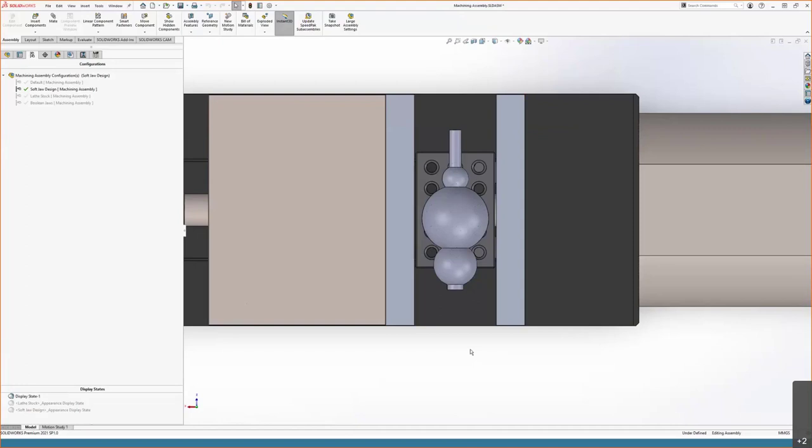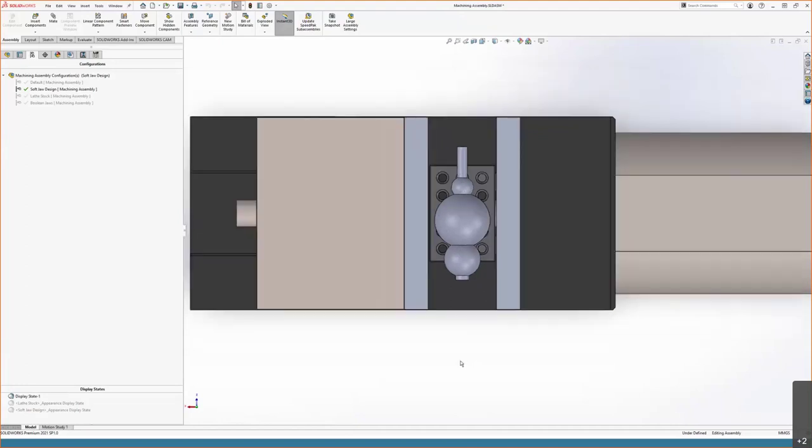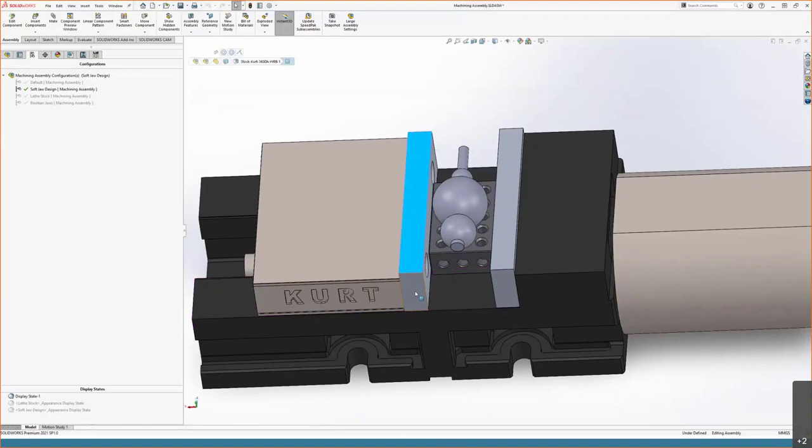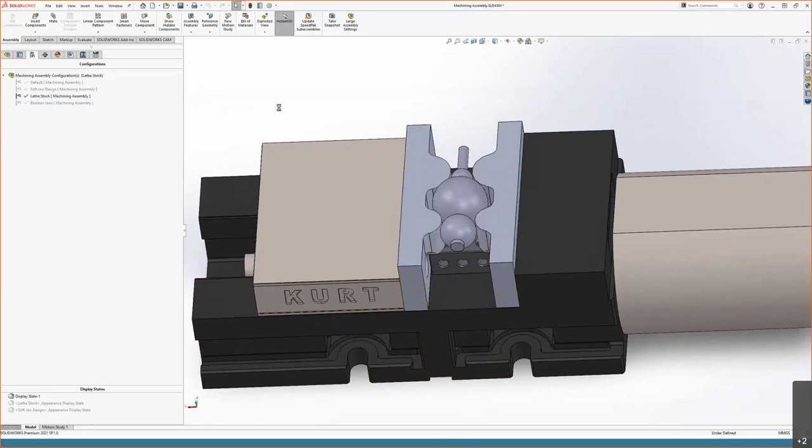This is a little bit harder to work around, and we can't get an arbitrary slice, I guess, that you can in the V block. Whether you're looking at a plane that's parallel from the bottom of your vise and looking up, or it's a little angled, you're going to have 3 points of contact on all of those axes. With the spherical faces, a little bit less so. And because this moving face on the vise does just that, it moves, we can work around that a little bit better. So here is the geometry that we've come out with